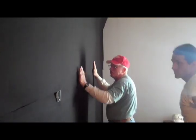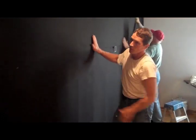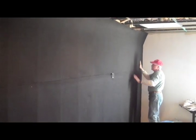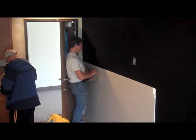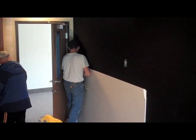If you're applying MuteX to the surface of an existing wall, not only will MuteX improve the isolation, but also make the room less reverberant, giving you a cleaner sound in listening or recording environments, such as studios and home theaters. But if your goal is privacy or quiet, as seen here, a layer of MuteX will decouple the wall from the stud that supports it.